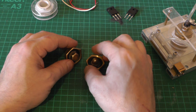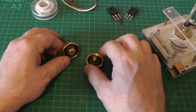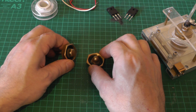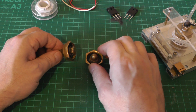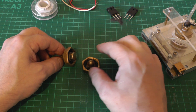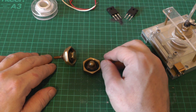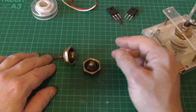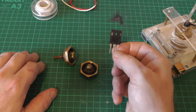Spark gaps have been used in excimer lasers, nitrogen lasers, Marx generators, and Tesla coils. They are the Chuck Norris of high voltage switches — really really robust. A spark gap only breaks if it catches fire, explodes, or is vaporized. Anything else doesn't matter; if we accidentally overvolt it or apply too much voltage to the trigger pin, it makes no difference whatsoever.